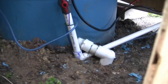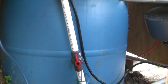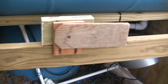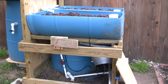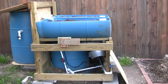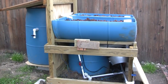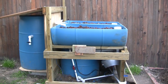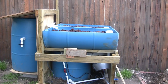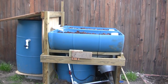That underwater pipe is hooked up to this and drains right in there. One of the ramifications of that change, which was kind of disappointing, was my original idea of having this auto-fill using a toilet valve. It worked fine under tap water pressure, but gravity pressure is not enough to engage one of those valves, so unfortunately that wasn't working to auto-fill it — it was basically always off. Rather than spend a bunch of money finding something else, my plan is to just keep an eye on it. The tank is large enough that I don't think I'll have to constantly watch the water level to keep my pump alive.